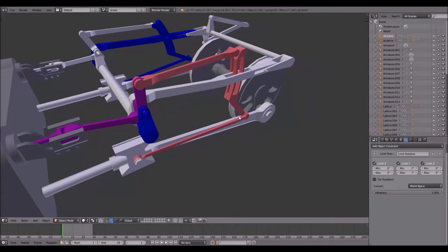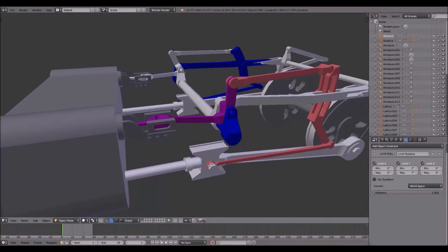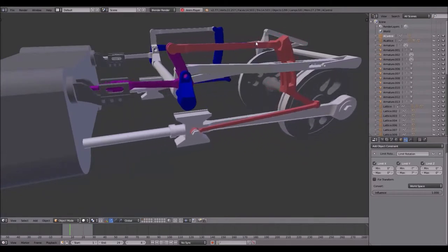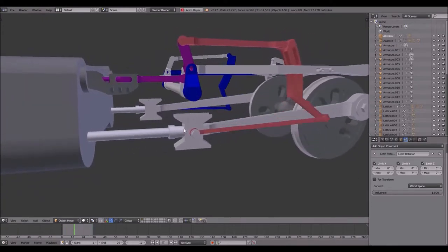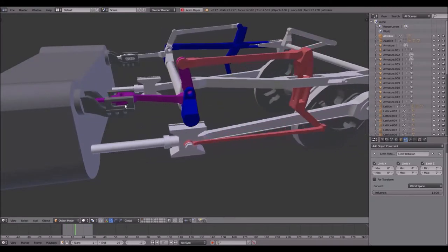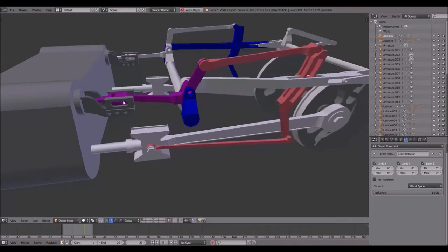Let's start with lap and lead, which are the red rods. From the crosshead there goes a rod to the link and from there to the combination lever. If I play the animation you can see that the purple rod — which is the combination of blue and red — is only moved by the red parts, or in other words only moved by lap and lead. When the crosshead goes to the left, the purple parts also go to the left. This is because it's a so-called inside admission. If it were outside admission, the motion would be inverted. Basically there is a double inversion — at the link and at the crosshead — which cancels itself out.